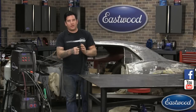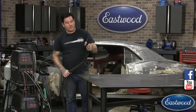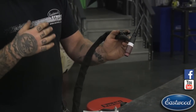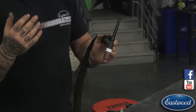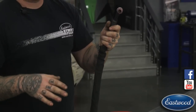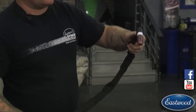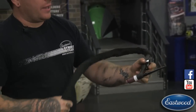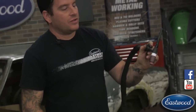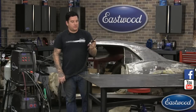There are instances in pipe welding where you may hold the whole entire torch differently. It works great for what's called walking the cup on tubing or piping. But for most automotive and garage work, you're probably not going to be gripping the whole torch that way. For finesse work and most automotive applications, holding it like a pencil grip gives you more control and you can move it around a little easier.